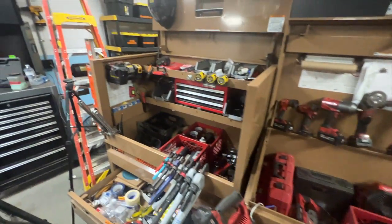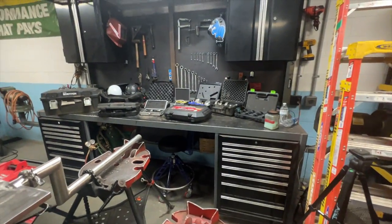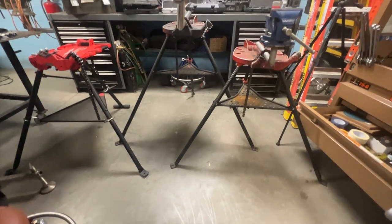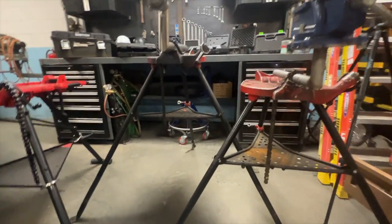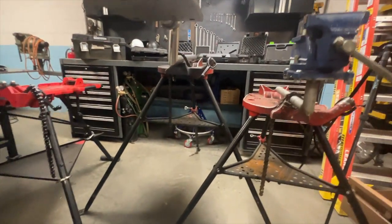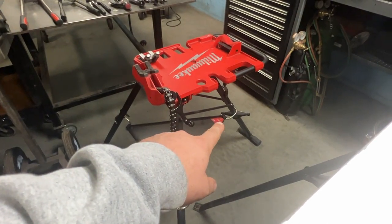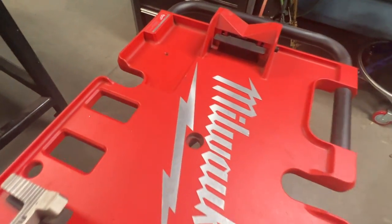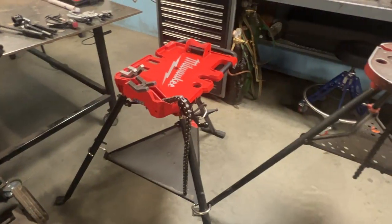Back box number one has all the power tools in the piano box, and hand tools and odds and ends in another. I have three tripods — I usually take two on the road. I've got two of the rigid pipe stands, your standard up-to-six-inch rigid pipe stands from Amazon. The one on the left is a little taller; I added seven-inch pieces to all the legs, which is a lot more comfortable for bench welding. Then there's the Milwaukee pipe stand — it has a leveling leg on the back, a removable tray, and a handle that collapses it flat to the floor. Very easy to set up, tear down, and store. I got a couple extra jaws with it: the stainless and the PVC jaw.